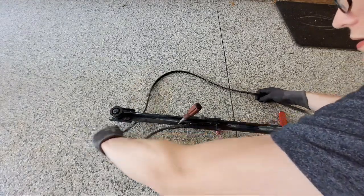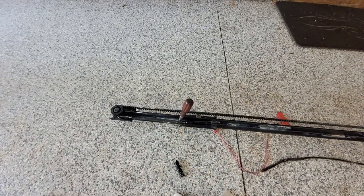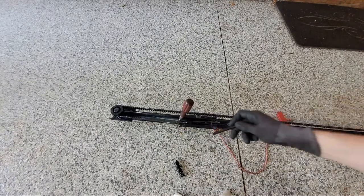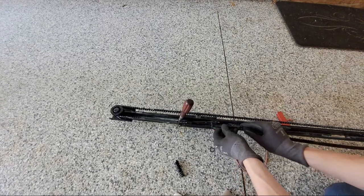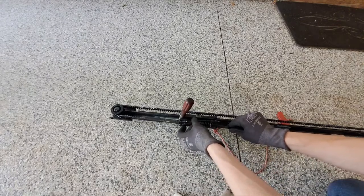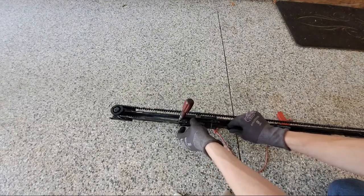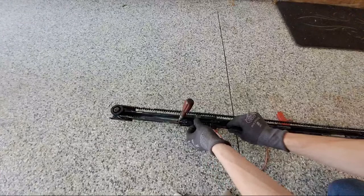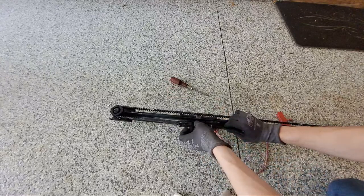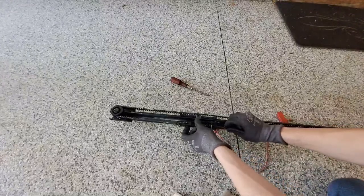And if I didn't already mention, this is the rail for the 8550. So I'm just going to bring that, loop it around the sprocket on top of the opener. And then this end sticks into there. And we got to tighten the belt now. And I always like to hand tighten it. You can also get that screwdriver out once you got the belt around the sprocket, because now the belt's just going to hold it in place.